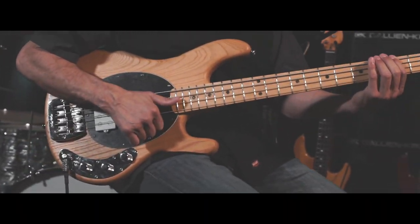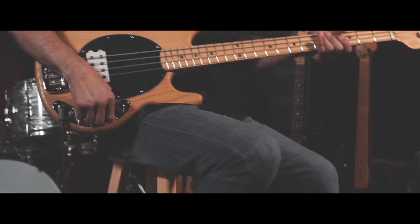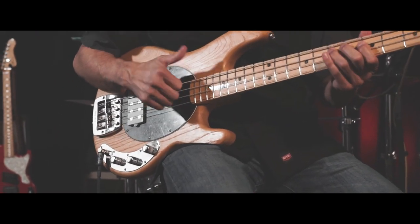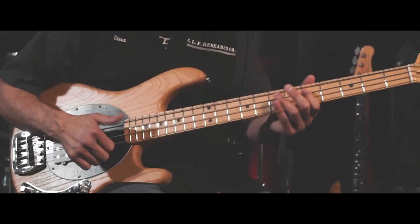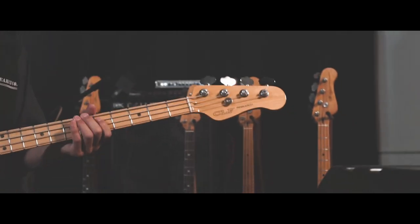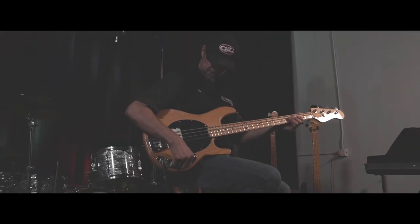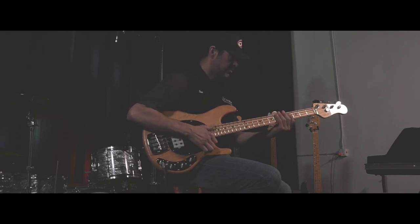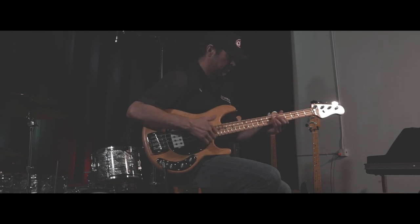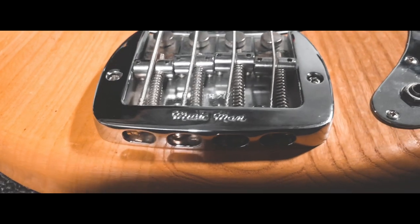You might often call it a 104K cap, 0.1 microfarad. So it's just loading and taking out some of the top end. It's kind of a neat thing with this switch. You can have the cap switched out, and you're in standard Stingray land, and you can roll back that treble quite a lot. But if you wanted a treble attenuator across the board to soften it, this little mini toggle is pretty cool.